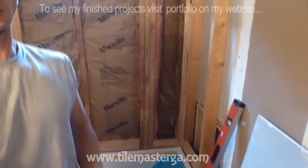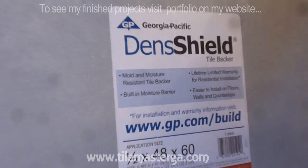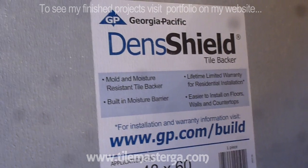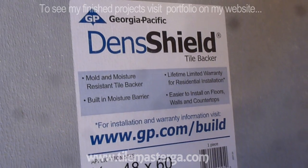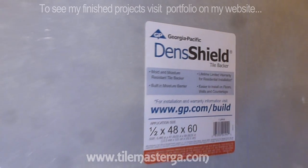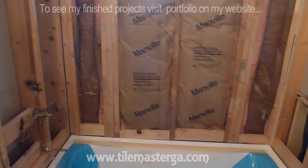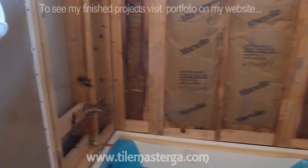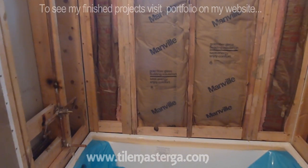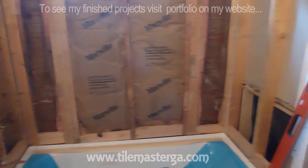And the board that I am pretty much always working with is from Georgia Pacific. It's a mold and moisture resistant tile board, and it also has a built-in moisture barrier. What it means is it doesn't require any additional moisture barrier. And I'm one of those people that do not recommend putting moisture barriers. The moisture eventually, if it gets in at some point over there, will get trapped and will cause you mold. It will cause sweating. So this is what usually happens.